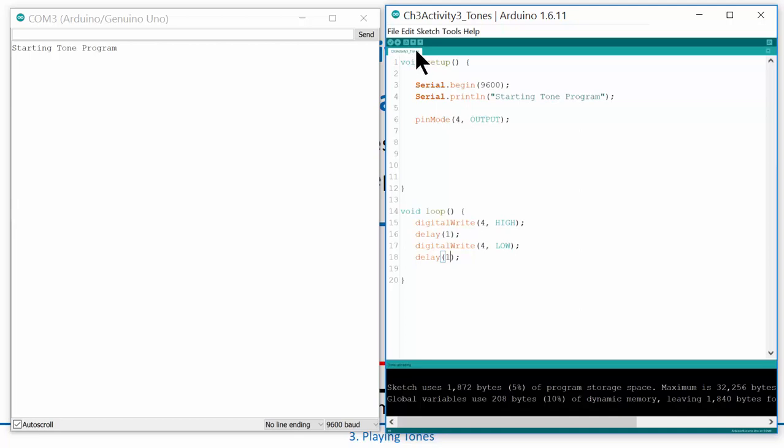What if I went as fast as I could — a high time of 1 millisecond and a low time of 1 millisecond? The frequency would be one divided by two milliseconds — that's about 500 hertz. Listen to this — that's about middle C, which is about 440. We've finally created a tone. The problem is we can't go any higher because delay() only accepts an unsigned integer, so I can't pass 0.1 to increase the frequency further.